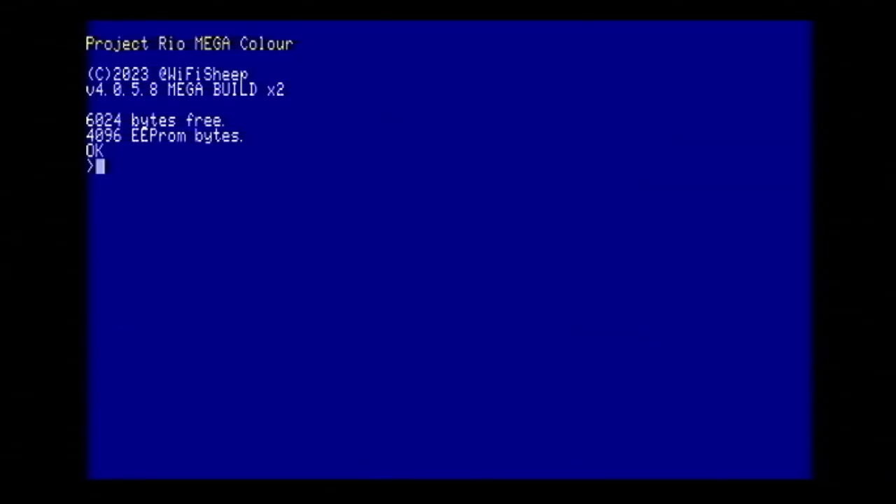Let's take a quick look at what the current alpha Version 5 system can do. The first thing you're going to notice is obviously we have much more RAM on the system — we've got almost 4K, or just over 4K, of EEPROM, and in this case we've got 6K available for memory. Bear in mind last time it was 1K of RAM and 1K of EEPROM storage. On top of that we've also got as big an SD card as you want to fit — I think this runs out at about 64 gigabytes, and I've got a 2-gig SD card in, which is more than sufficient.